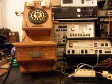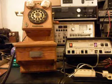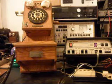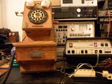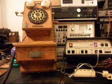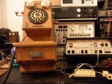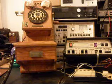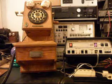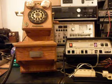What happens in electronics a lot of times with circuitry is when there's a voltage on them, and I'm going to plug this back in in a second, you can lose everything or lose your functions. Then if it's unplugged for a long time, you may regain your functions again, but they never seem to work properly, or it'll just go back into that same state where, when voltage is applied for a while, it doesn't have any function any longer. And sure enough, the key tones do not function properly.